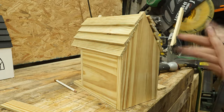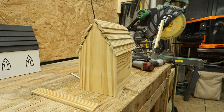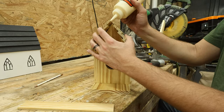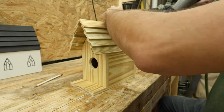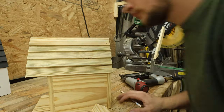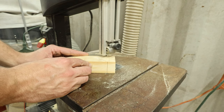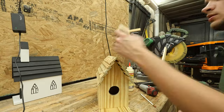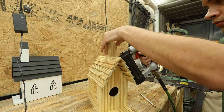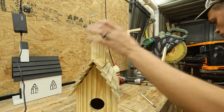For the top cap, there is going to be a gap up there — the wood glue will hopefully fill it. You put one side on and then come around to the other side and put it flat across, so the very top point is basically a butt joint. Now the only other piece we have to fit is the steeple. I'm getting the angles just by holding it up to the end of the roof, tracing that, then cutting it out on the bandsaw. Then we simply glue and brad nail it in place — and our church birdhouse is built.